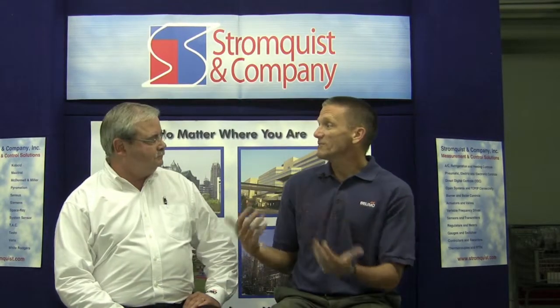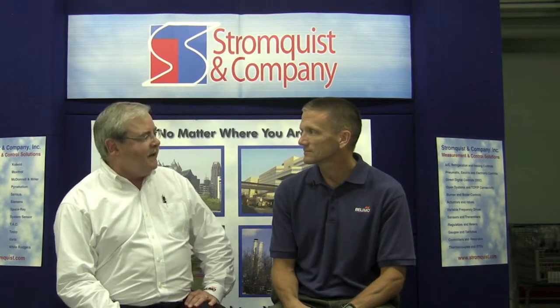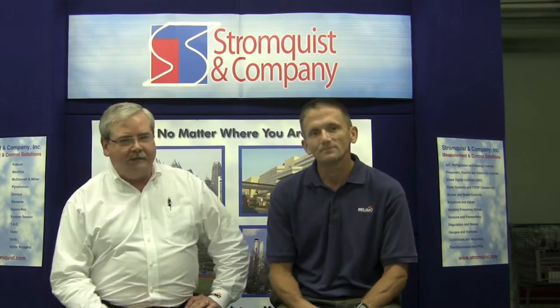Okay, Mark, speaking of saving money, zone valves, very popular. We sell zone valves by the case, especially on bid day because they are typically the cheapest item out there. But it really doesn't make the most fiscal sense, especially for those building owners, does it? I don't really think it does, Kevin. Zone valves have one great advantage. They're cheap. They have a low close-off pressure, low pressure rating, very poor control.